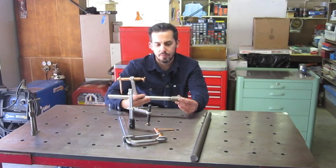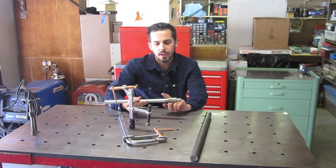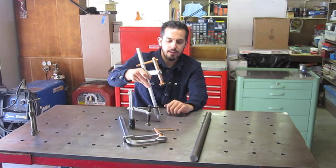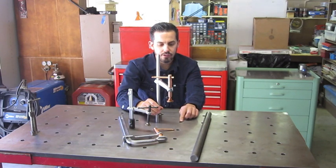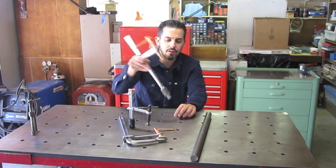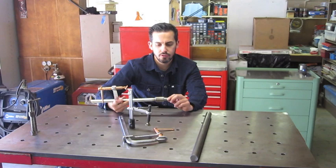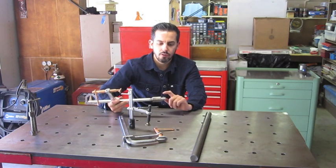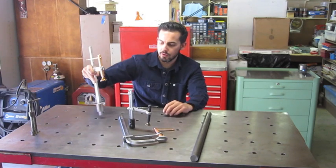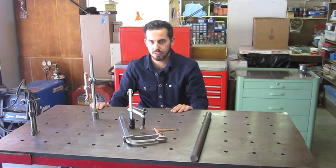And this is a clamp I bought for relatively inexpensive, and then I machined this piece and then welded it onto here. And it fits inside these holes, which are 5/8 of an inch. So they're 625. These are machined down to I think about 622, 623. So today I'm going to go through the process showing you how to make this particular clamp so you don't have to buy one like this if you have a table to fit these clamps.